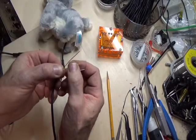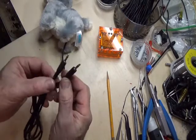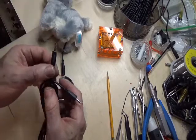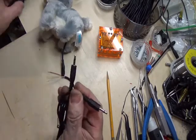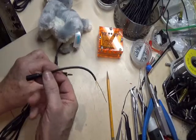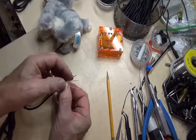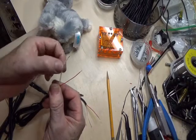We're going to try the same thing with this cable. It's also got white, yellow, and red. What I've made up here is a test cable — I've taken one of those stereo extension cables and added a mono plug to it, with the correct wire combination already done inside. So I know this is going to work. I'm going to plug that into the toy and plug this into the cable I want to test, activating it as a switch to see which wires turn on the toy. On the other one it was red touching either white or yellow that activated the toy.